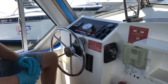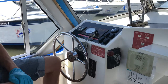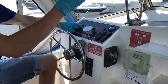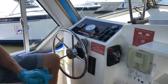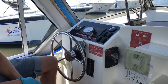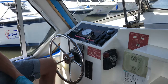The bow thruster controls the front of the boat. To use it you have two on buttons which have to be pressed at the same time, and you get an orange light appear. If you want the bow of the boat to move left, push and hold to the left and it will thrust the boat over to the left. If you want it to the right, vice versa. When using the bow thrusters, try to use them in three to eight second bursts — anything too short uses too much power and anything too long will drain the batteries. When finished, push the off button and the orange light will turn off along with the bow thrusters.